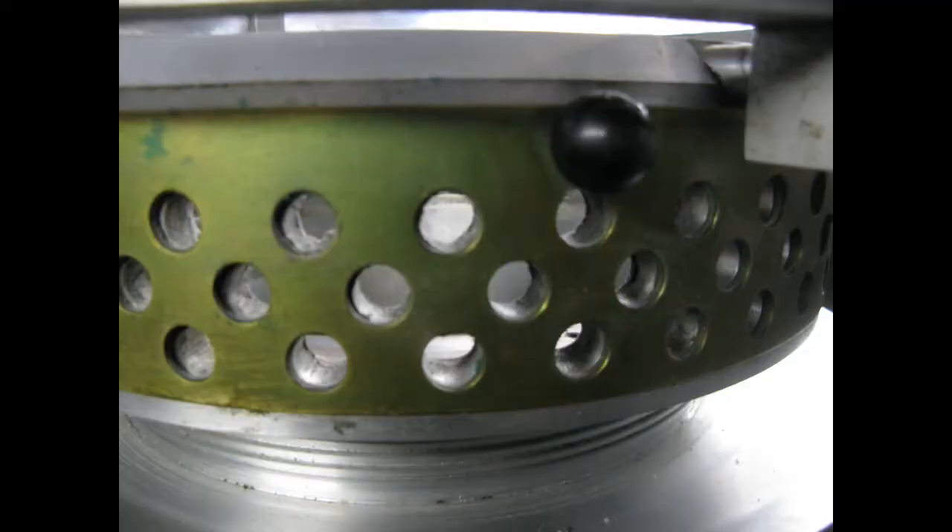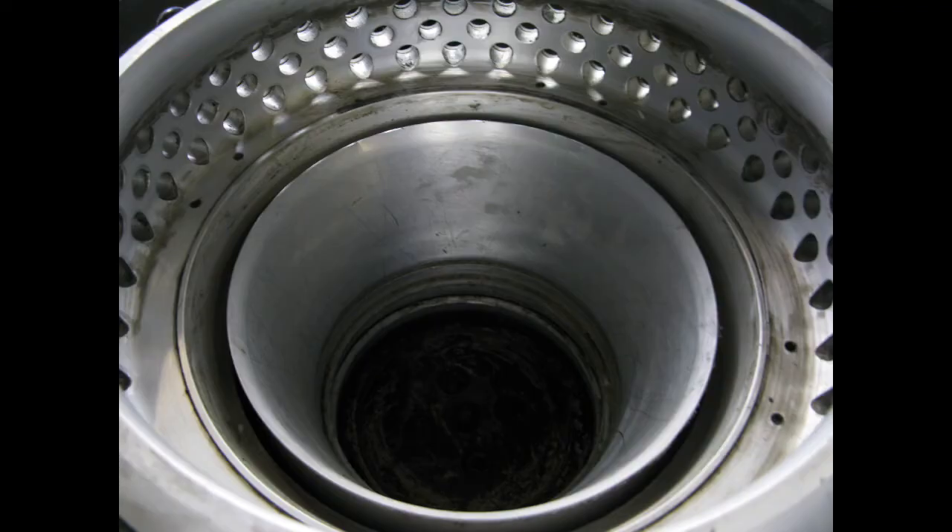There are other adjustments that you will most likely need to make. The air ring blower speed determines the total amount of air available at the air ring. You then have what is commonly called the basket, the cone, or forming ring — also called the forming cone — which can be raised or lowered depending on the bubble size and bubble thickness.